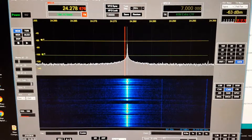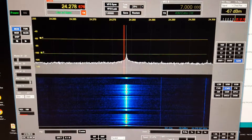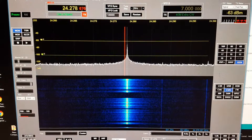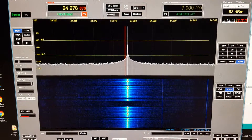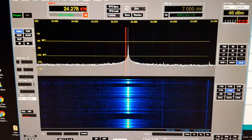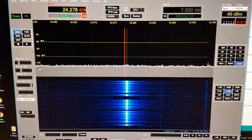So I'm using two Arduinos and two SI5351s — one of them is acting like a beacon, the other one's acting like an LO for an HF radio, like a transverter, down-converting from 144 megahertz to 24 megahertz. Kinda neat.